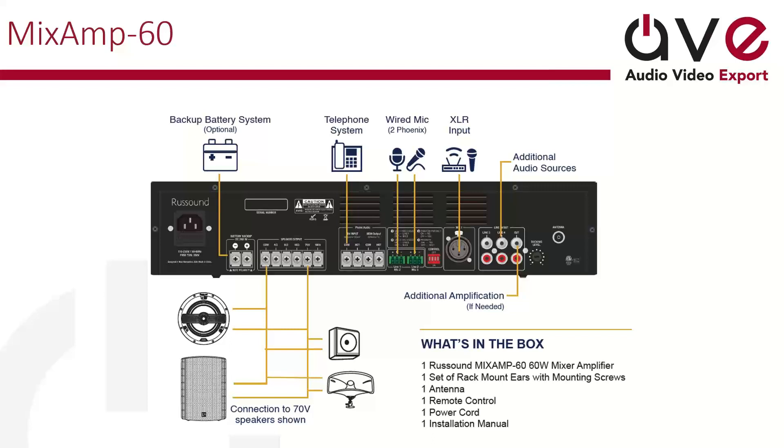The advantage of the MB series from Panamax or the F series from Furman is that you've got not just battery backup, but also really great features like filtration and conditioning of power. We definitely recommend that. But if you wanted a cheap and cheerful DC battery connected straight into this, you could do that — just make sure you're matching up the voltages and amperages based on what's on the back. You can see telephone connections, wired Phoenix connectors for line inputs, Phoenix connectors that can be either mic or line, RCA inputs, and a single XLR — which can be for a wired or wireless mic. It does come with rack mount ears and an FM antenna.